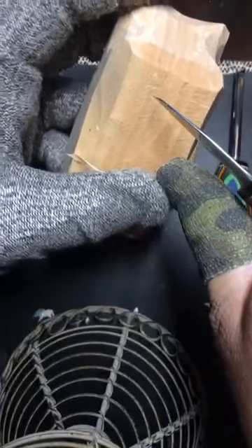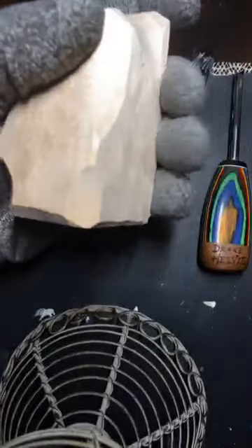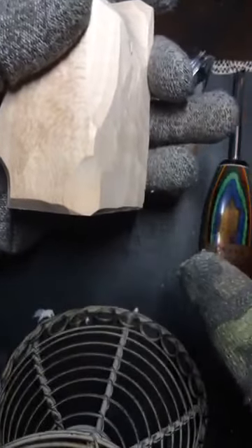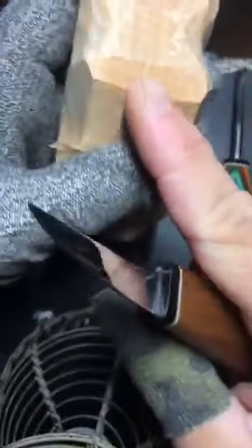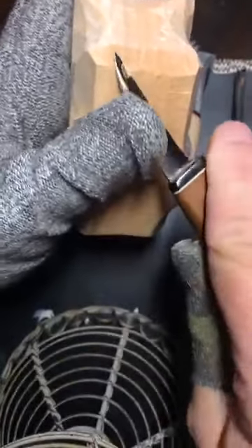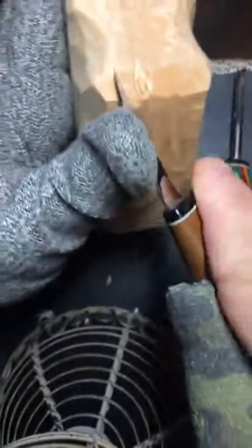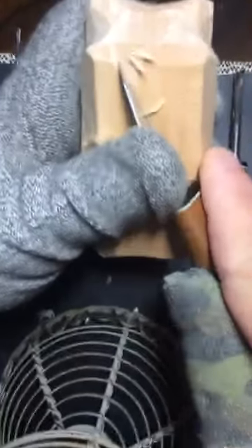One of four or five things is going to happen when you cut straight in — you're going to possibly break the tip off. We all hold these knives here, so if we slip out of the piece of wood, our fingers can't be replaced. So typically if I'm adding texture or wrinkles, it's a quick in-and-up slice cut — just a quick twist. There's no specific way to describe it other than it's just a quick twist.